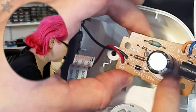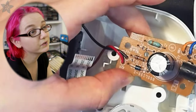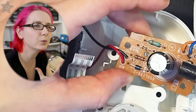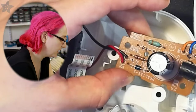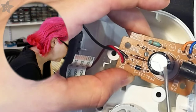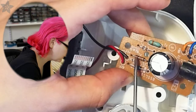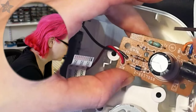So you've got the DC jack here. You've got D2, a diode. Luckily, if you plugged in the battery wrong, or plugged in a center-positive 9-volt adapter, because everything in the world uses 9-volt center positive except for this label maker, this is a protection diode. You've got a big capacitor because there's maybe a motor driver, just in case you have a really crummy 9-volt. Not sure what this is. Probably a drain resistor to drain the capacitor.